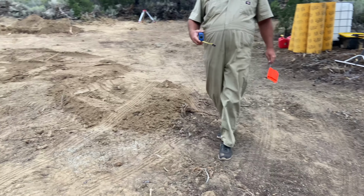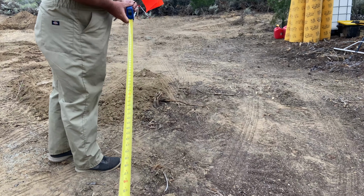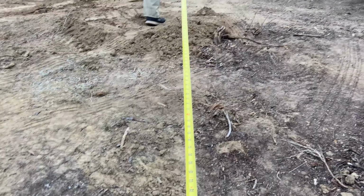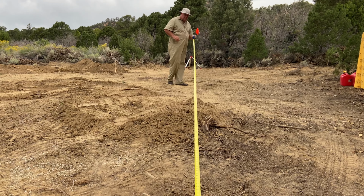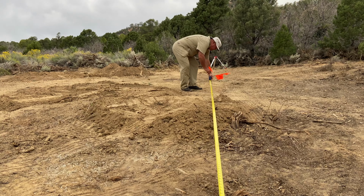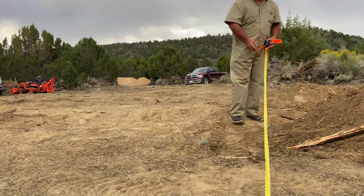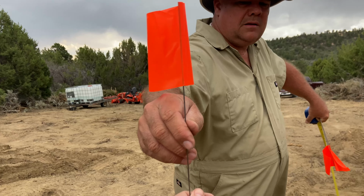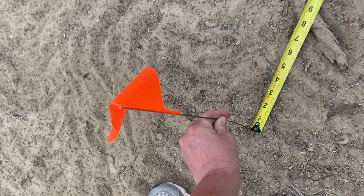Okay, so we're gonna measure out 40 feet. How far does the tape measure go? First, we need to measure and lay out a 44-foot by 12-foot spot and decide where the sonotubes are going to be placed. Wow, that's gonna take up more space than I thought. There will be 10 sonotubes placed, 10 feet apart, for the 40-foot container.